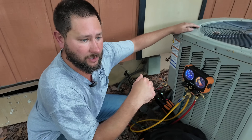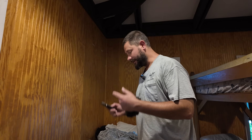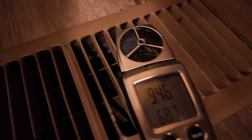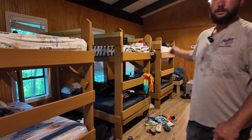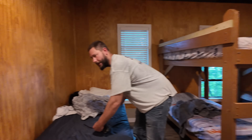Now let's check airflow and supply air temperature. I wish I'd checked airflow before, but there was literally nothing coming out. Using the anemometer now — we've got a good amount of airflow, looks like 900 feet per minute. Supply air temperature is 58 and it's dropping. It's about 77 in here, so based on the thermostat reading we've got a 19-degree split. Before it was 68 and you couldn't feel any air.